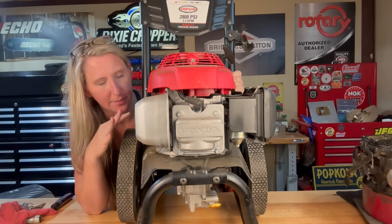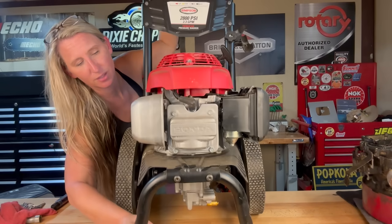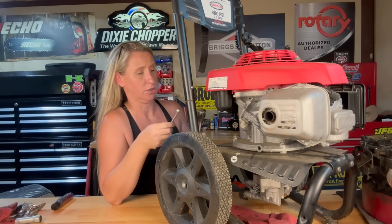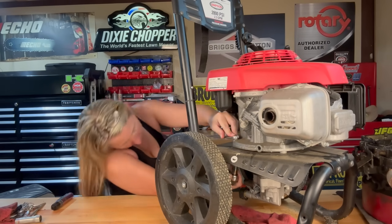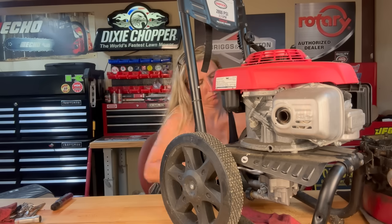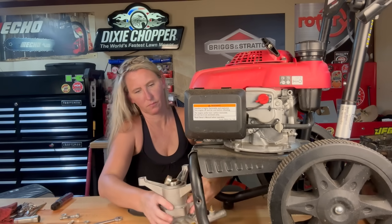The only thing slightly precarious about the situation is how you're going to unbolt it and bolt it back on. Because if you have it laying back like this, the bolts that hold the pump on also hold the engine on, so the engine's going to fall off whenever you remove the pump. The best way to do it is to have it sitting straight up, mounted up on something so you can see underneath. If you're removing one of these three-legged vertical pumps, most all of them take a half inch — it's got a half inch bolt head and a half inch nut. You're just going to grab some half inch tools, stop your nut up top, and I put a rag underneath because the pump is going to fall down whenever you go to take it off. Just like that.